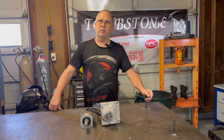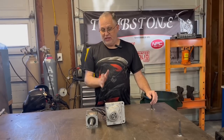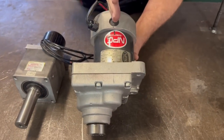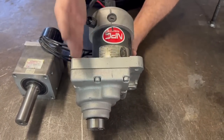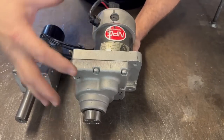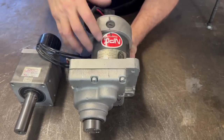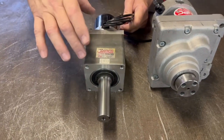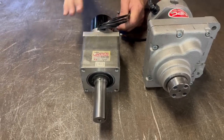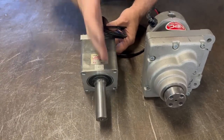With the last version of Tombstone we had some issues with drive, and that was my fault in how I laid things out. For years we used the NPC motors for drive. You can see the line that the motor runs - the way the gearbox is laid out, the output shaft is slightly offset forward. To upgrade the power system, we moved into using these new gearboxes, which are quite a bit smaller, lighter, but have more power. The inline for the motor and the output shaft are the same.